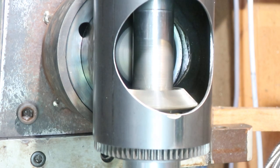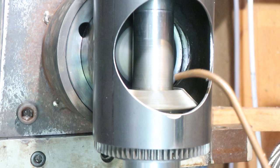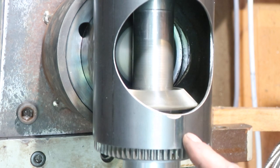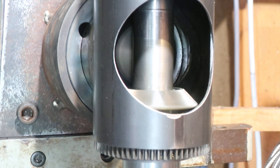Obviously it's going to fling oil everywhere — I'm not too worried about that. The back gear pair appear to be running quite nicely. There's more oil on that. Eventually, once this is running, there will be an oil feed from the bottom and a pump, because this is just going to leak for the moment. We'll let the oil run through the bearings and pump back up to the top. That's on my list of things to do, but there's other stuff to do before that. For the moment, I'm quite happy to run it as a total loss.